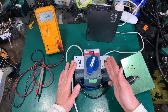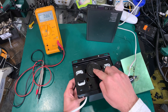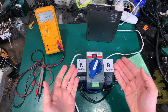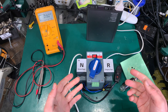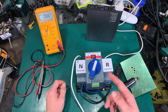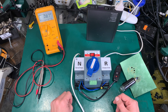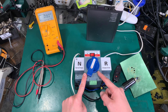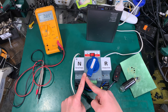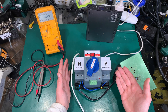That starts to use a lot of power and a lot of money that you are going to waste. This device is the answer because it has a motor. The motor makes the switch and then turns off — it's not going to draw any current except for a very small relay that handles the logic. You are not going to energize a big contactor coil all the time. There are limit switches that will know when the switch has turned in one direction or the other and will turn it off.